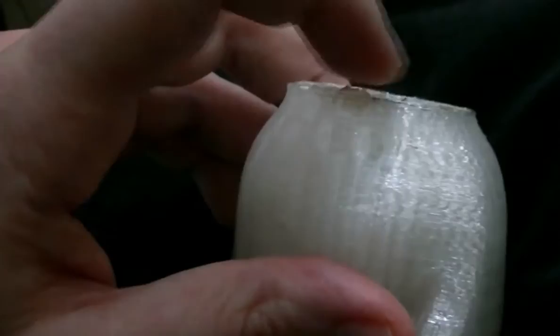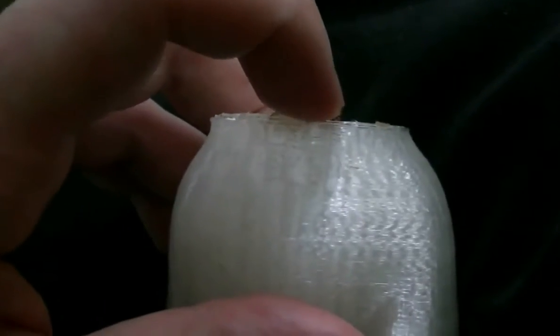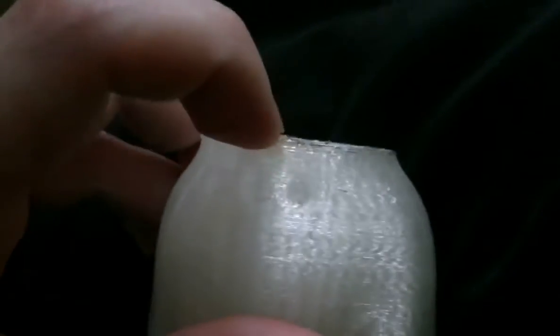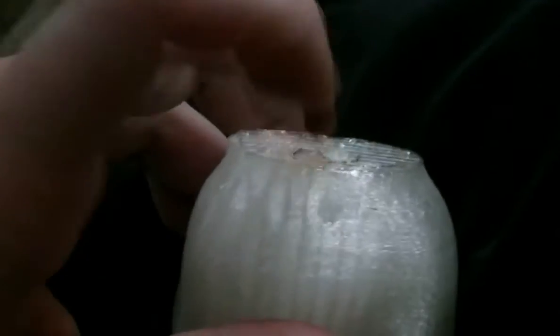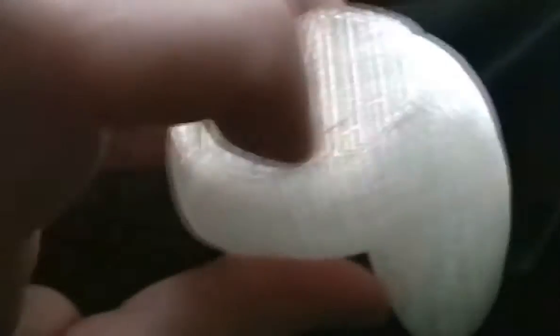Because of the filament — the filament is something that solidifies quickly — a solid part like that was just impossible to remove. The printer was doing its internal job and suddenly a bubble appeared. So the nozzle shoots out some bubbles. It's strange because everything was going right, and this bubble just messed up the entire statue. There was a kind of scratching phenomenon each time the print head had to work.